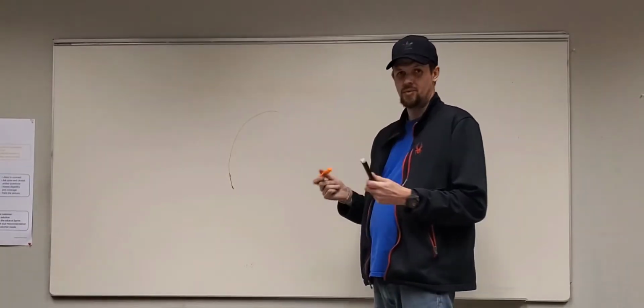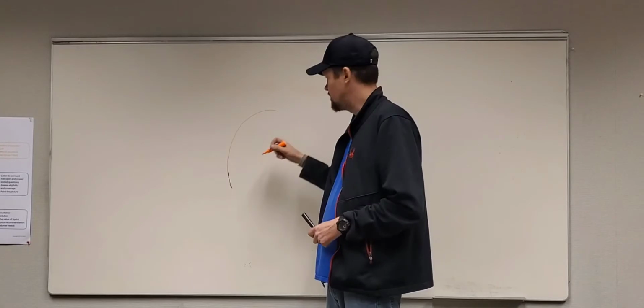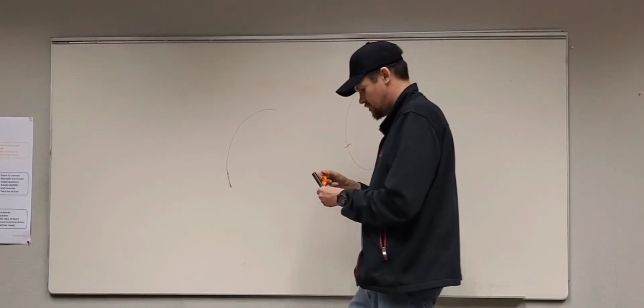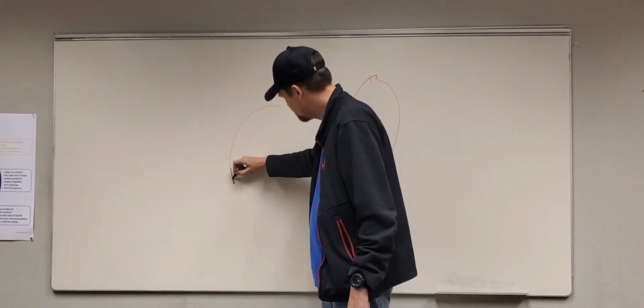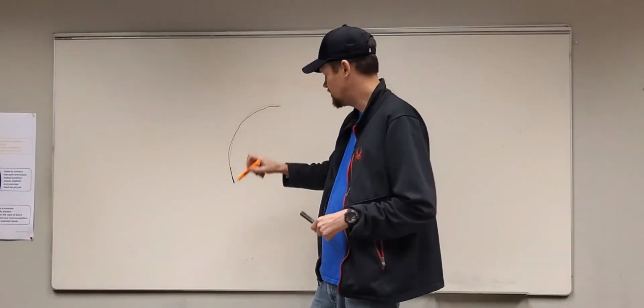of a curve. With arc support, what the program does is it post-processes the G-code. It sees this here, and it's like, oh, that's just this section here of the known ellipse. So what we're actually going to do is replace those 300 lines of code telling it to do little things, and tell it to just go in one path, one extrusion, no starting, no stopping, no jittering. It actually tells it to draw the curve.